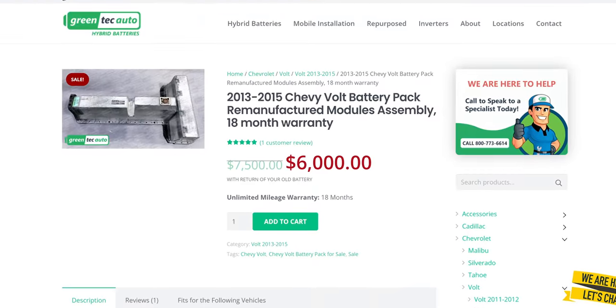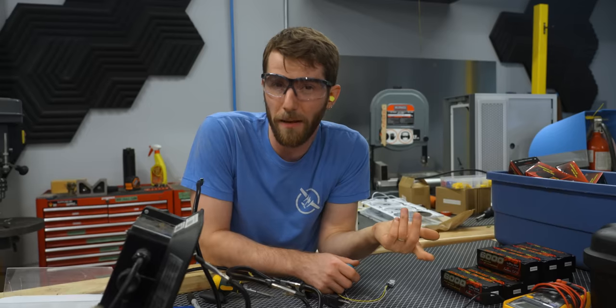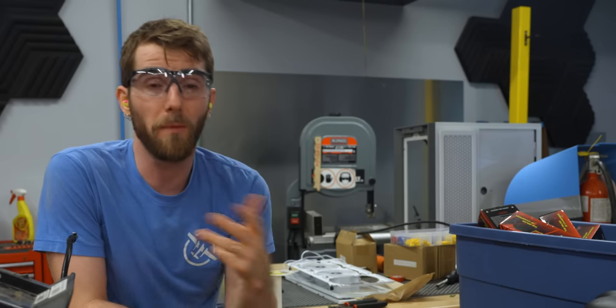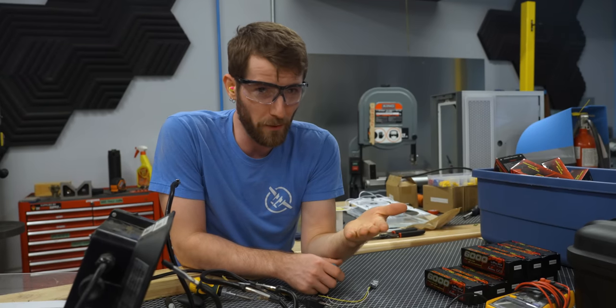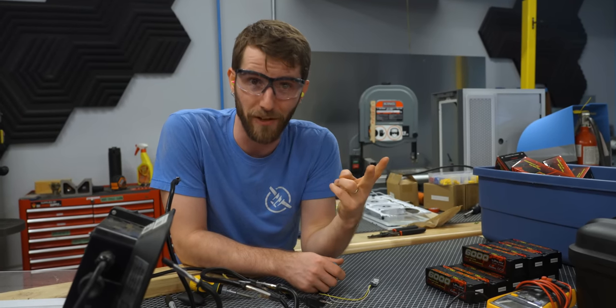A second option for powering the fan was to buy the battery from a Chevy Volt. It's a little on the high side at 360 volts, but because of how GM manufactured it, dropping the voltage to something that would be usable for our fan is actually relatively simple. The problem with that solution is that, for one, a Volt battery is darn expensive, and for two, once we fiddled with the pack, charging it could be difficult and/or dangerous.